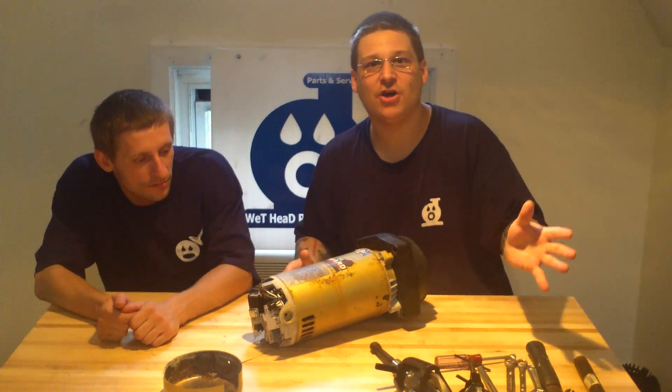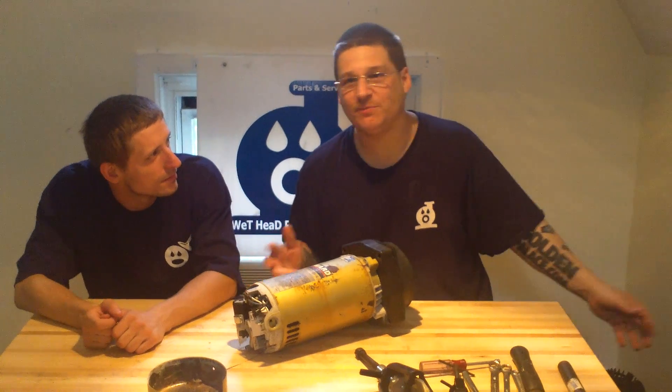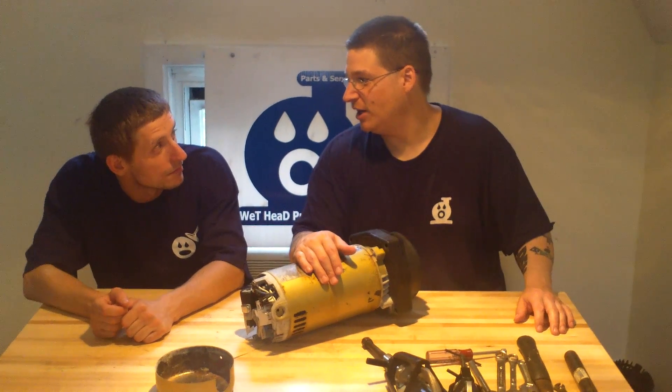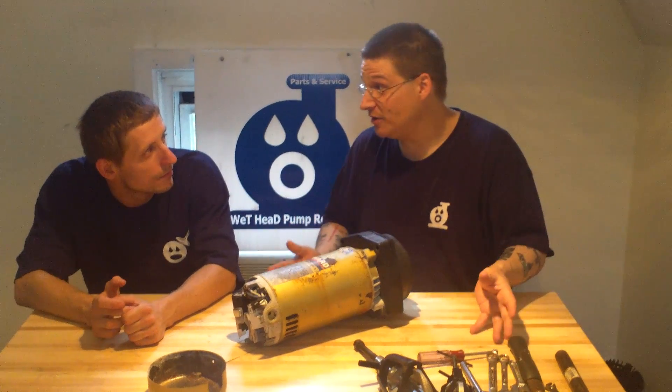Let's say you're in your backyard or you buy a new pump from Craigslist and the guy's like, 'used pump for like $100,' and you're like, 'that's cheaper than $400.' But then you get to your house and the guy had it running on an extension cord — and an extension cord is only 110 volts, but your pool system is 220.